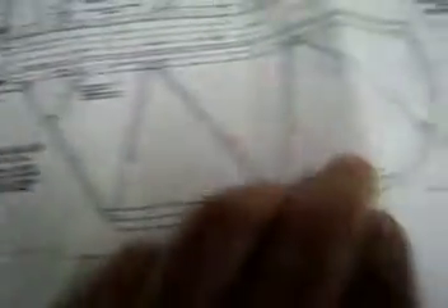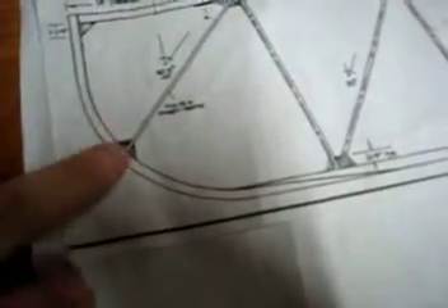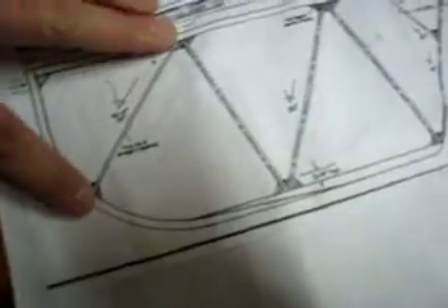C is very easy — it's just a straight taper relative to this. But I'm thinking that we don't really know what the thickness here is, because it's going to be a small interface between quarter inch to three-quarter inch here. So this is three-quarter inch, and then it needs to go to a quarter inch. I have no clue what the transition dimension is, so I'll be doing a straight three-quarter all the way here and then blending it for a smooth finish. That implies I'll make this a full rectangle, just glue it up right here. Then once this is done, I'll put a small line on it and cut it straight from whatever that dimension is, till my one inch and a quarter here.